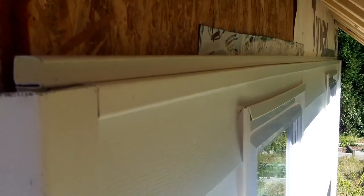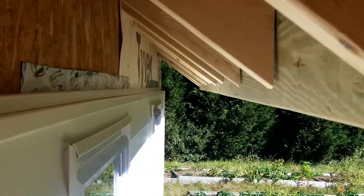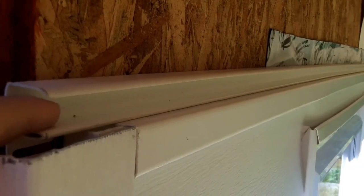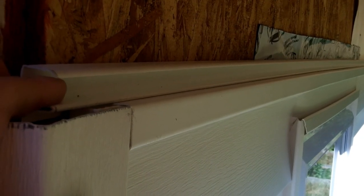So up here on the ladder — you'll see here's the little runner for the soffit. It's level with the fascia board here, so that the soffit goes inside that little pocket and it will screw into the bottom of the fascia board. That's pretty simple — you just got to stack them one on top of the other and go down. I haven't done that anywhere yet.